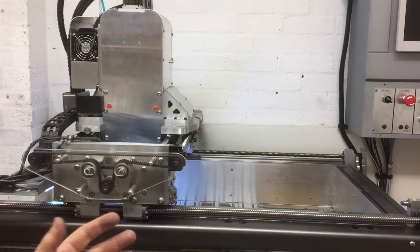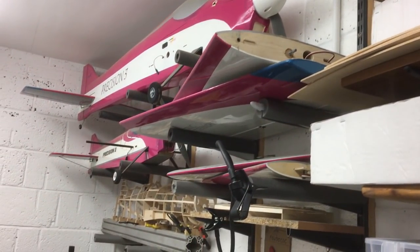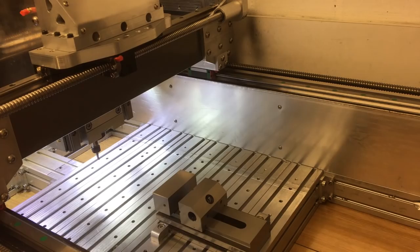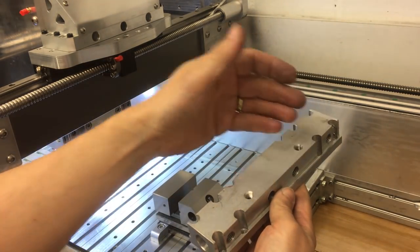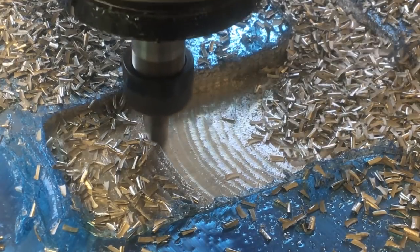So why this particular design? Well, I need to cut very large panels out of light ply, balsa wood, and plywood for making radio-controlled model aircraft. So I needed a pretty large cutting area, probably larger than you could get with a regular mill. I also needed a high-speed router and a pretty large swept area. I also needed to cut out pretty large chunks of aluminium, leave a good surface finish, and have accurate hole locations — so I needed a pretty accurate and stiff machine.